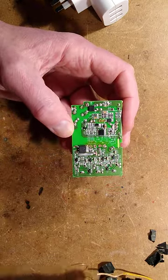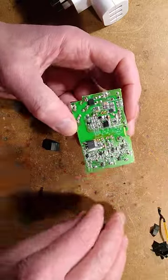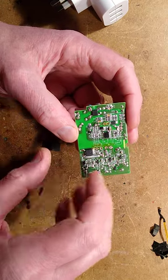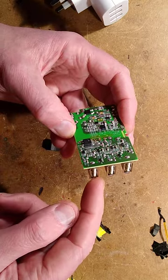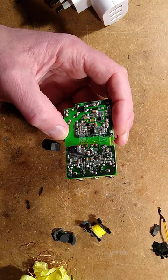The output side, after a very well-wound transformer with good electrical separation, has a synchronous rectifier based on a chip and a MOSFET which gives almost lossless rectification and three power control chips, one for each port, that in the event of an overload or short circuit will simply shut that circuit off. It looks a very good charger.